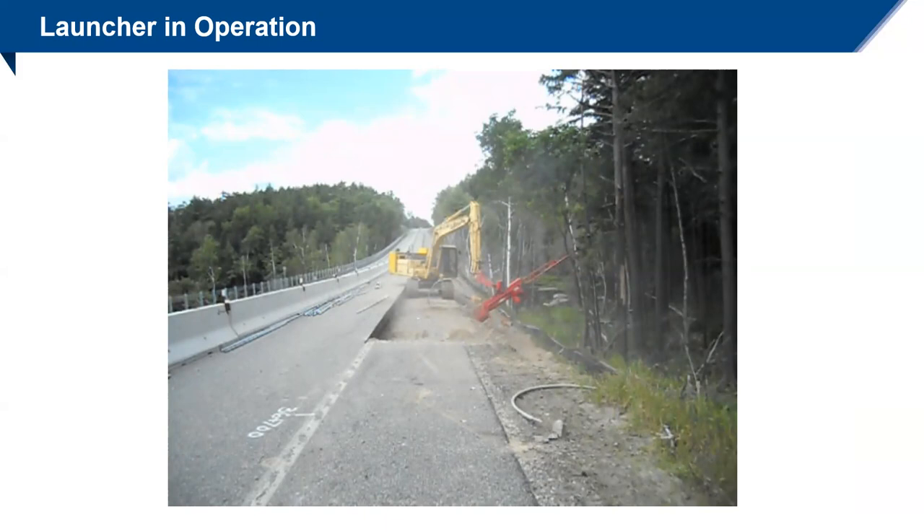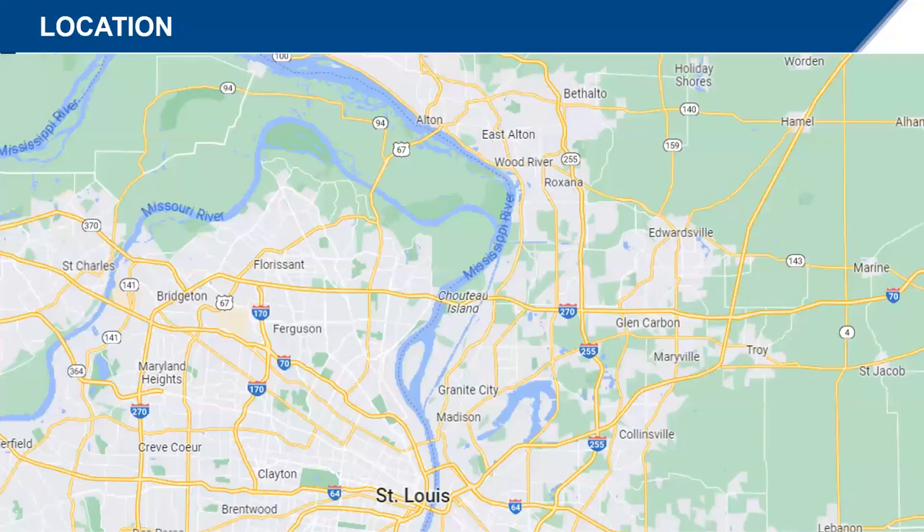They've done tests where they put stickers on the side of it, launched it in, and excavated it — the stickers are pretty much intact. What they surmise is that it creates a shock wave at the tip, peels the soil open, lets the tube follow in behind it, and then the soil collapses around the tube. Since the tube doesn't have a direct connection, when we go to put our facing on, we grout a number-six thread bar in there so we have something to put a nut and plate on for the soil nail facing.